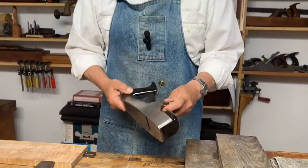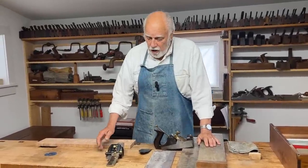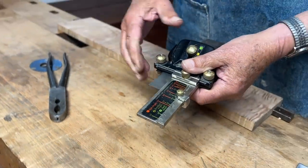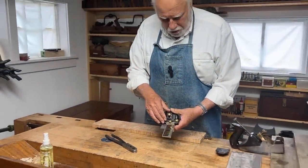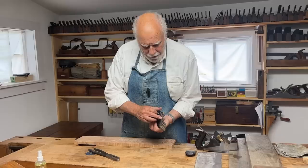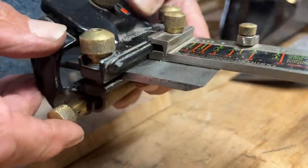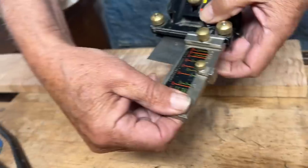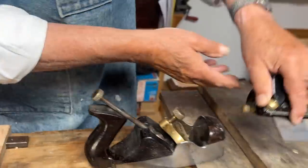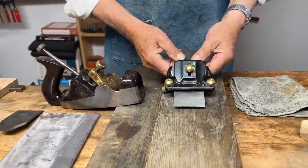That's number one. Now, the next thing that we're going to be doing that doesn't have to do directly with the stones is the use of a jig. In the past, I've talked about the benefits of sharpening by hand without a jig, but today we're going to be using one of the many different kinds of jigs you can get that are designed to guarantee that the angle of the bevel that we make when we're sharpening remains the same. So I've set this jig up, I remove the little guide, and I now have a jig which, when I put it on a stone, it will be at exactly the right angle. So let's get to the water stones.